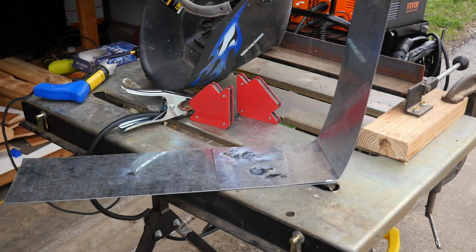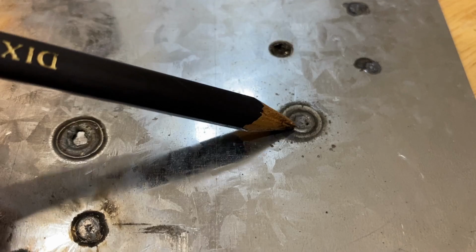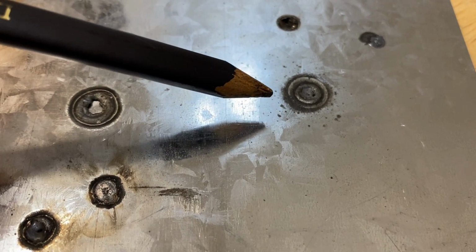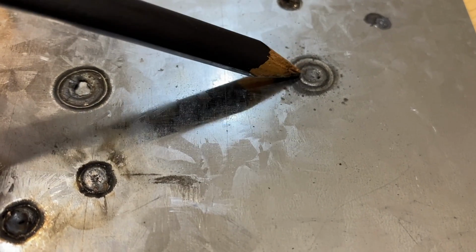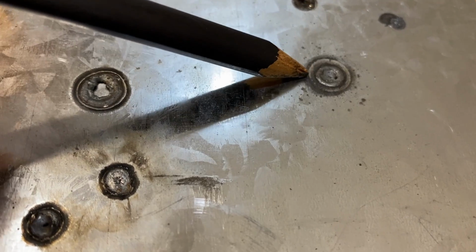So wow. Okay. So here's a close-up of what we did. This is the successful spot weld right here that actually worked at 100 amps. I might be using the wrong polarity. Comment below if you know. I don't remember whether it's supposed to be a positive or a negative ground system on the table where you're doing the spot weld through. But this did work successfully, and it did give me a good strong spot weld.